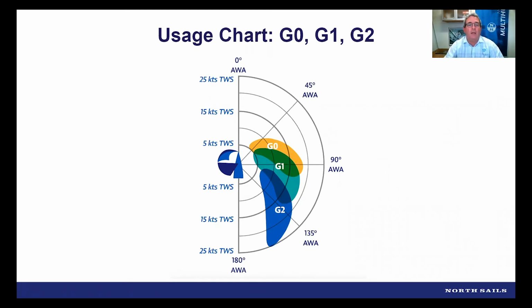But basically, in terms of the brands, they're all pretty good at this point. The key really comes into, we keep saying it, how the sail is going to be used. If it's a relatively lighter reaching sail like that, it opens up the possibilities because you're not really going to be pushing the load limits of an appropriately sized furler. If I get the sense someone really wants to use this as an overgrown Genoa and we're up in cloth and they're going to push it like crazy,